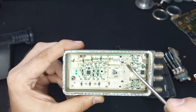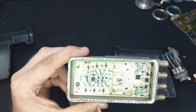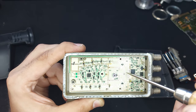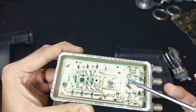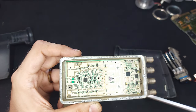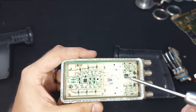And these are capacitors, so if you have two traces running parallel to one another, they're capacitors. If you have stubs, they're inductors. Like this is an inductor, for example. Sorry, this is a capacitor, this is an inductance. I'm not sure you can actually see, the glare is just horrible on this material. This is very special. The dielectric in this PCB is very special, because it has to have very low losses in RF. And we have what I think is just a plain linear regulator, and some basically reverse bias T's. So they're meant to strip away the DC and feed it to the circuit and pass the AC to and from the thing. I'm not sure this is going to send anything back anywhere, but it's most likely just a preamp and a down converter.